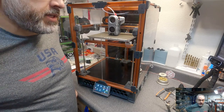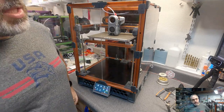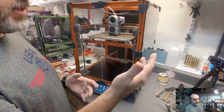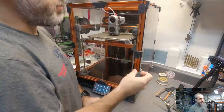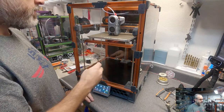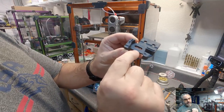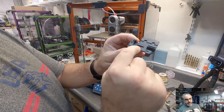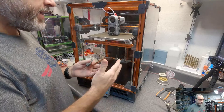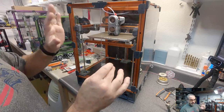Torx Fighter, I have both. I have a Galileo that's set up well and printed hundreds of hours on it. This is my only LGX, and kind of an update that I've mentioned on the stream before: right after I got it built, I did the test print on stream with no problems, but further prints, I was getting layer shifts. And it turns out, I don't know if you can see the wear mark there, but I had missed a shim. So I had a bearing rubbing right on this printed part. So that, and some MAX31865 PT100 over and under voltage errors I was getting.